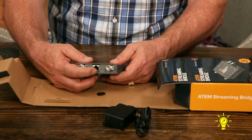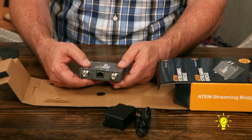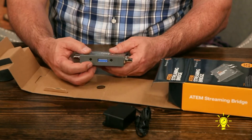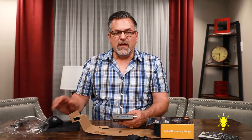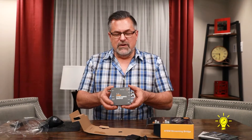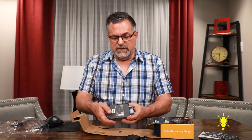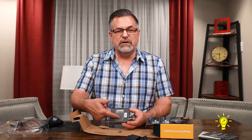The main feature is that you can come out of the ATEM Mini Pro and ISO and go directly in here, or you can go out into a network out of your ATEM Mini Pro and ISO and then attach this to the network as well and link those things up. You also have the dip switches here, so you could have a number of these. Two of these dip switches are spoken for, but the other ones you can use to have multiple versions of the ATEM Streaming Bridge in another location. On the back, you have the ability to write down what you're using those switches for, so you could name the different bridges that you have.